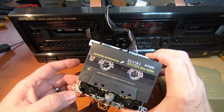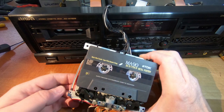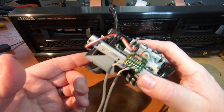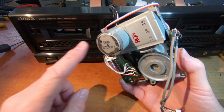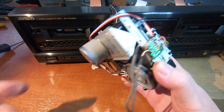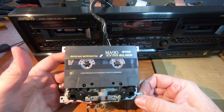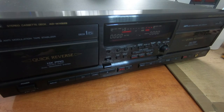What I'm going to do now - I won't do it on camera because you've seen it before - is clean the tape heads, adjust the azimuth, and set the speed as well. The speed adjustment is on the back of the motor - there's a speed control adjustment hole and you just put a small screwdriver in there to adjust the speed. So that's this cassette deck finished. I've replaced the belts, which was the main cause of the problems. I've also cleaned it up, lubricated the deck, demagnetized the heads, cleaned the heads, and tested it out.